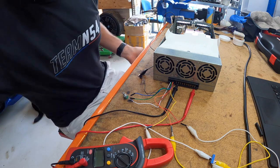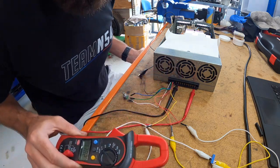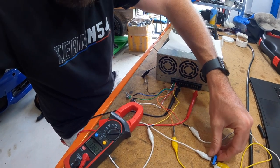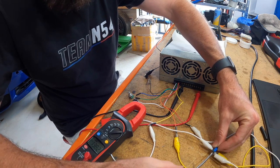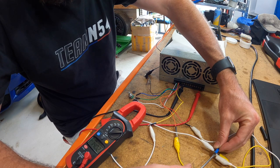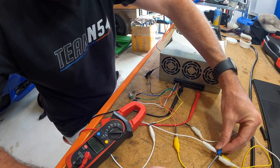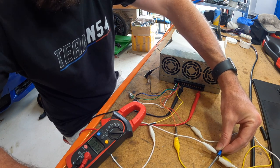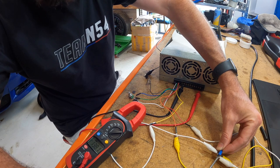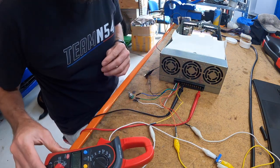I didn't check the voltage! Turn it back on. We're at 13.8 volts at the moment. While we're here, let me increase the voltage — I've got the voltage potentiometer here, or the trim pot. Let's turn the volts up: 13.95 — let's go to 14, why not. We're good. We can adjust voltage, that's awesome. I'm going to set it at 13.8 no load — I think that's probably going to be about where I want it to be, maybe 13.6. We've got 13.8. Let's just turn it off.